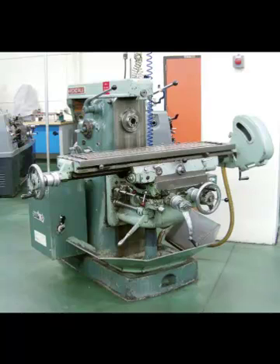This machine is very handy for doing helical milling on gears. You can see the shroud at the far end of the table which can be geared to the lead screw of the milling machine table in order to advance the work held in a dividing head to cut a helical gear. What makes this either a plain style or universal style horizontal milling machine is the table — if the table swivels, it is a universal horizontal milling machine rather than a plain style.